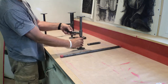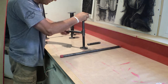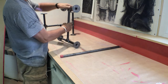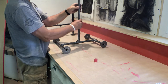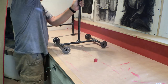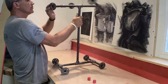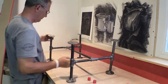The next thing I'm going to do is put in my cross member. These just need to be kind of snug — you don't have to really wrench down on them, just get them fairly tight. If you feel you can go another turn, go another turn. The last thing I'm going to do is put my long piece in. This piece will give it a little bit of support about halfway in the middle of the width of the table and go the full length of the table — just a little piece for a bit more support. After the support goes through the first set of legs, I'll put the second set of legs on and tighten it as tight as we can get without really wrenching down on it. You'll find you'll have to tweak this as you move along.